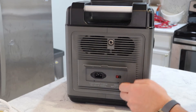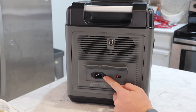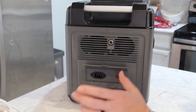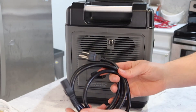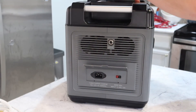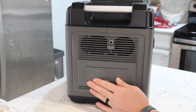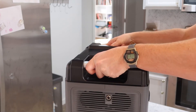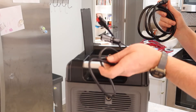One really cool thing about this unit on the charging side: it's got a 1,100 watt supercharge. It takes 100 to 120 volts AC, 50 or 60 hertz input, and will charge this thing in two hours — very impressive. The AC to DC converter is already built into the unit, so instead of having one of those big power blocks, all you need is a regular cable to charge it via a compartment on the top. You can also plug into the Anderson connector for solar panels or a car charger. It's got overcharge protection on top so if lightning hits it, it'll pop that out and hopefully not damage the unit. The top has nice carrying handles and a storage box — in there I've got the power cord and the MC4 connectors for solar.